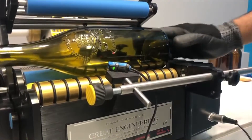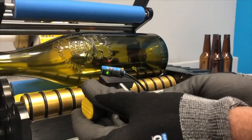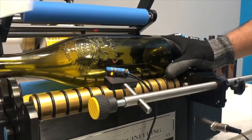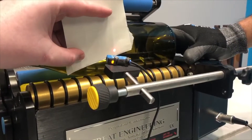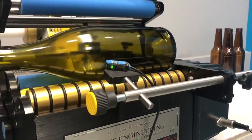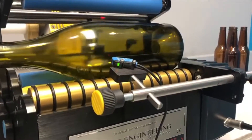Our light is still green, so what we have to do is actually move it a bit closer towards the embossing until it changes and remains a solid orange color. Our light has now turned orange and we can see it's triggering off this point of the embossing — we have a very clear, crisp light. If we now rotate this bottle around it remains green until it hits the embossing and triggers as it initially hits the embossing every time.